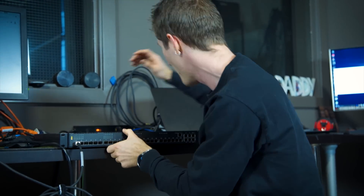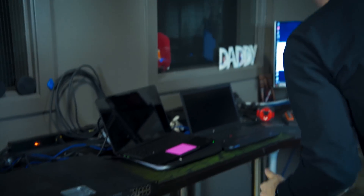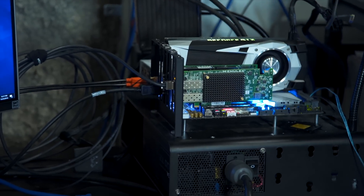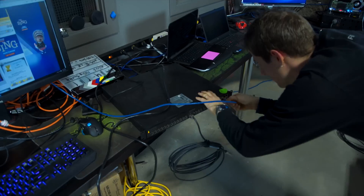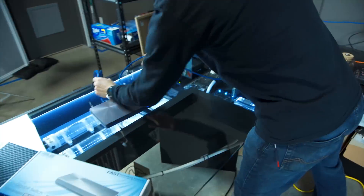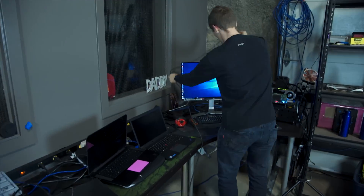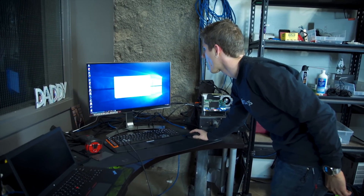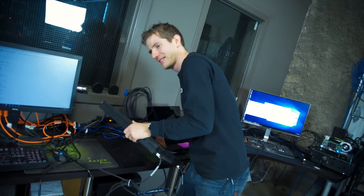While you will have to deal with some caveats — for example, you're gonna have to use SFP+ direct attach copper cables or fiber optic modules in order to connect everything, and these can be quite expensive, anywhere from around $20 to over $100 a pop — you will also need matching hardware on the other side for your network cards. But there's more good news, because SFP+ cards can sometimes be had for cheaper than RJ45 equivalents. If you're willing to do some fooling around with the various firmwares and get command-line Linux on it, this baby looks like it could be a pretty good value if you want more 10 gigabit ports and you're willing to give up the convenience and silence of a desktop switch like the ASUS.